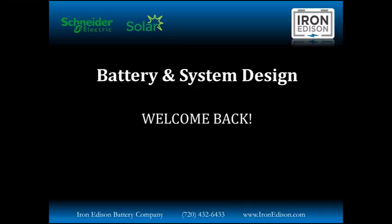We had one person asking about replacing the electrolyte in a nickel iron battery. And yes, that is something that we do recommend doing, but typically about every 10 years. The reason behind that is over the course of charging and discharging the battery, you're going to get a little bit of a carbonate buildup in the electrolyte, and that's going to result in a very slight degradation in its electrical capacity. Typically, we see maybe about 1% electrical capacity loss per year because of this. Now, by replacing the electrolyte, you're going to recover almost all of that capacity loss. So about every 10 years or so, that's what we recommend, but it really depends on use.